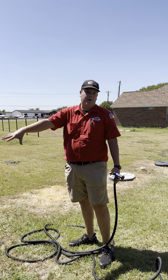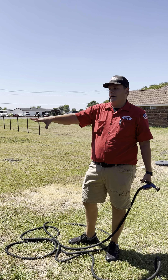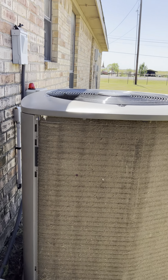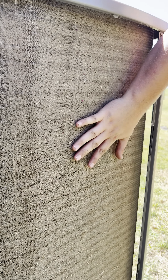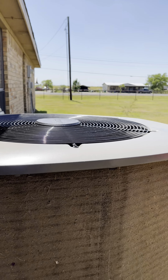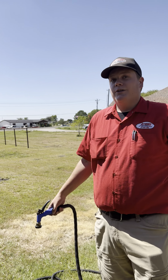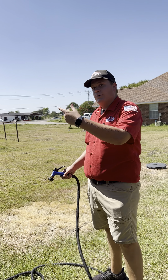I have gone ahead and just broke this one down. It's a lot easier to see the coil and then I can actually show you what I'm talking about. As we can see, this condenser coil is really dirty, really impacted. We're not getting enough airflow through these coils to cool off the refrigerant while it's coming out of the top. And what we're doing is basically choking off the unit. The best way I like to describe it is try imagining running a marathon while breathing through a straw with your finger at the end of it.